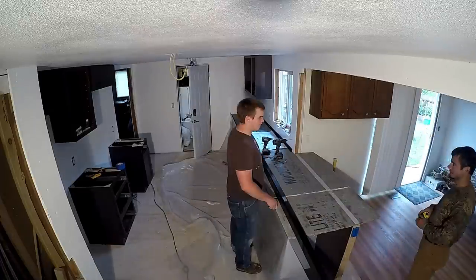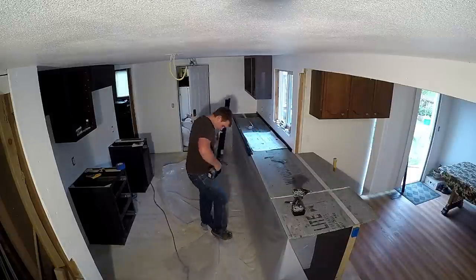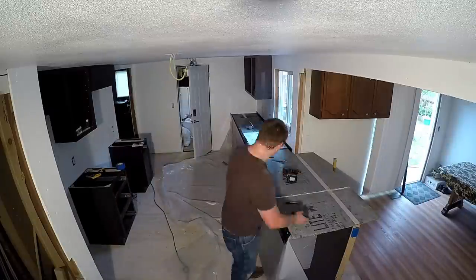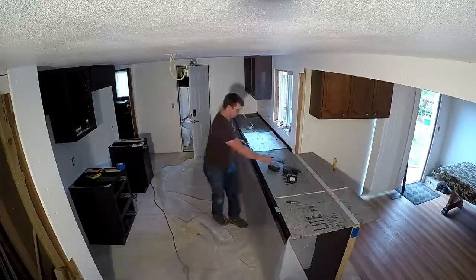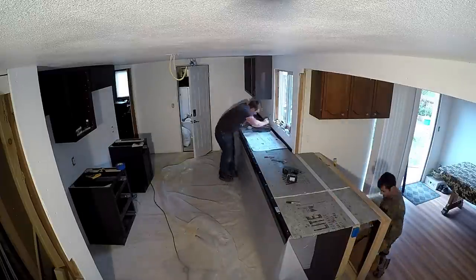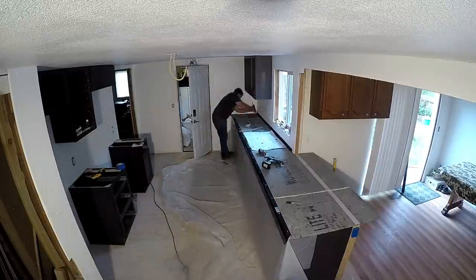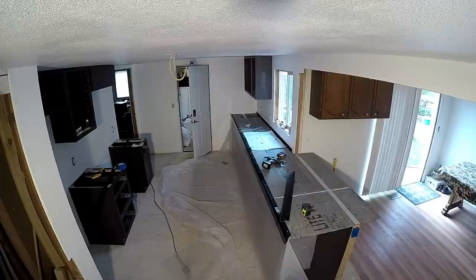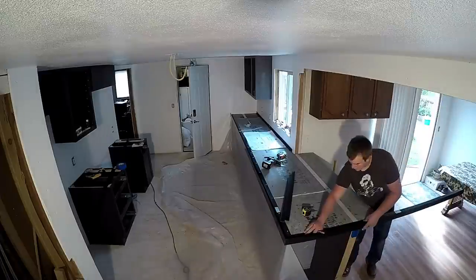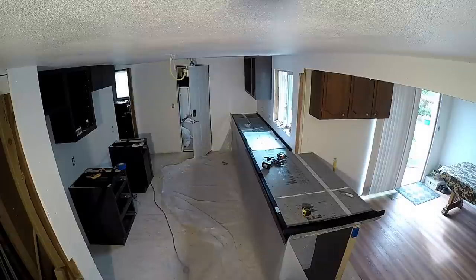As you can see here, I have a bar overhang. My brother-in-law was helping me out and he made a support frame that sits underneath that 10-inch overhang for the pour, so that just the DuraBoard isn't supporting the concrete before it gets secured. I do recommend having multiple people — at least two if not three — helping you, especially during the pour. It's good to have two people running concrete and at least one doing the finish work. It makes things run so much smoother, and you really can't do it by yourself.